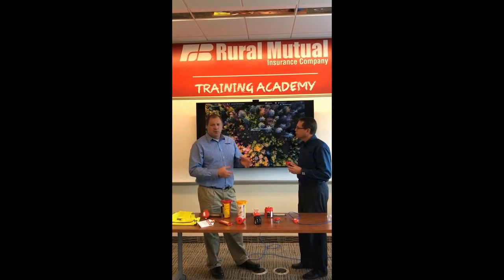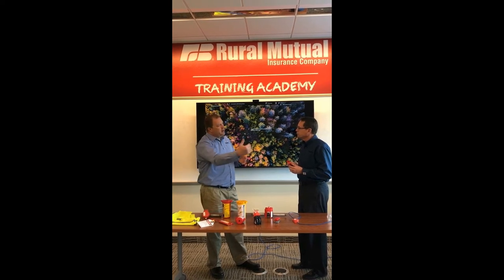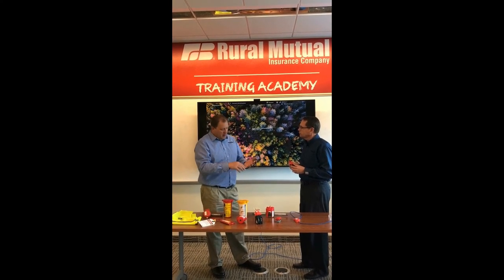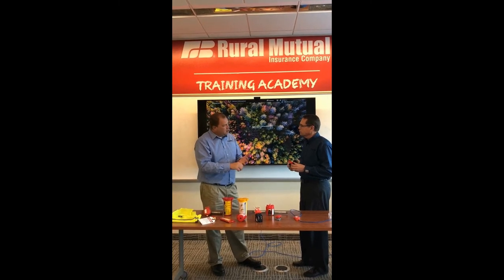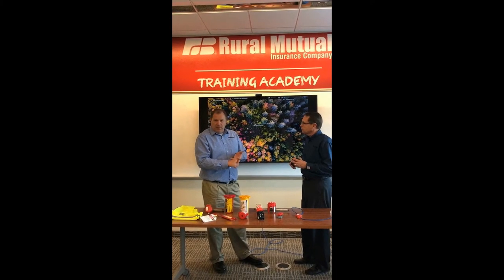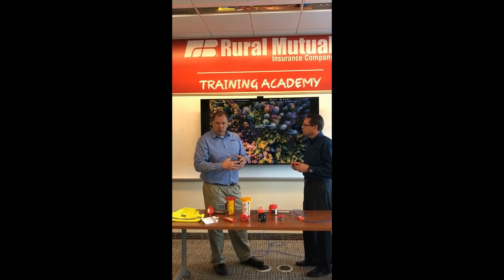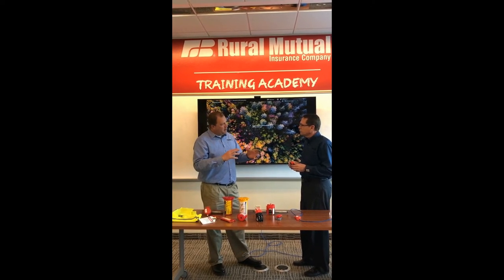The other part of it too is going through and making sure that there are no other energy sources or stored energy in that piece of equipment. Again, we talked earlier about chemical energy and thermal energy, something as simple as burning yourself on an exhaust manifold. That would be something where we want to make sure we have time to cool it down. Still kind of in that lockout tagout realm.